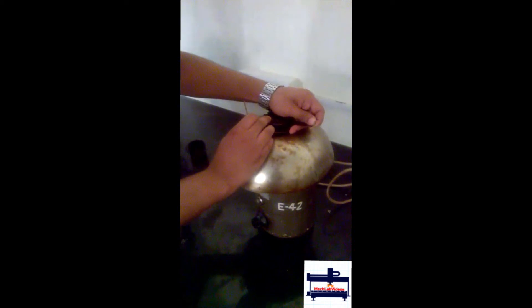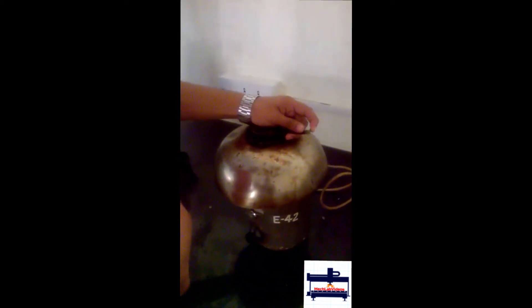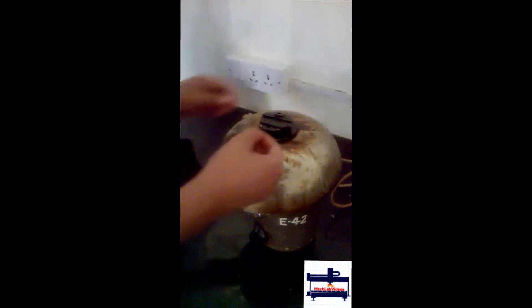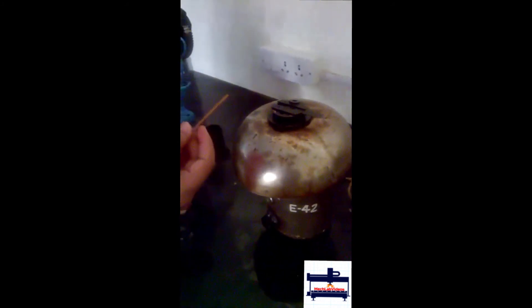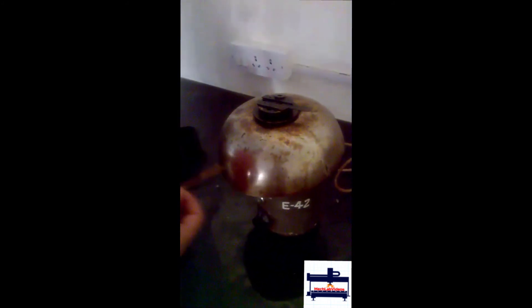Open this and try lighting it. At every 2 degrees Celsius, which will be measured with the temperature kept through this gap, we have to try lighting the oil. At one point the oil will — you can see a flash, and that is the flash point. After some time you will see that the oil starts burning, and that is recorded as the fire point.